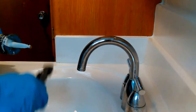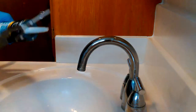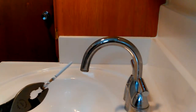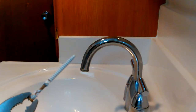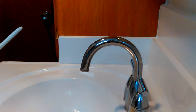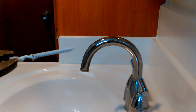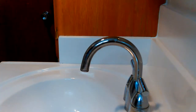Shut the drain so that I don't drop anything down in it. And I mentioned that before, but I didn't think to say, use a 3, 3.5 inch screw. Boy, that works good because it pulls the caulk back out with it. A nail doesn't do that as well, and nails are more prone to rusting, and it'll get on your caulk when you start squeezing it out.